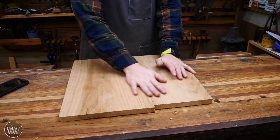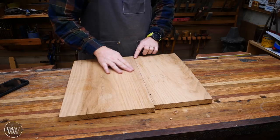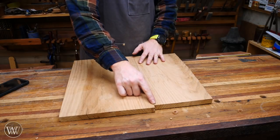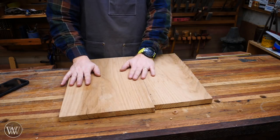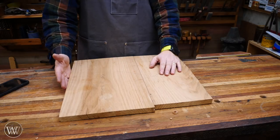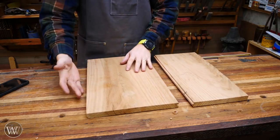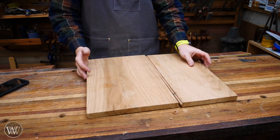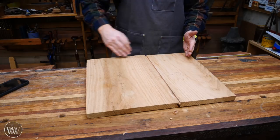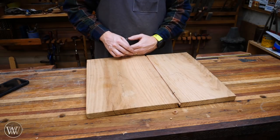Now we have these joined together and we need to make this a really nice, clean tabletop. That joint — I spent my time working on that and I'm very, very happy. I can feel a hair in one spot, but otherwise nothing. This will not take much time to smooth out. What we need to do is joint this edge so that we have a reference surface and can make all other measurements off of it. I'm going to joint this edge nice and flat, put this together, measure off 18 inches, make a mark here and here, draw a straight line, and cut this to 18 inches. Then I can joint one side 90 degrees to this side, and do the exact same thing the other way — 18 inches.